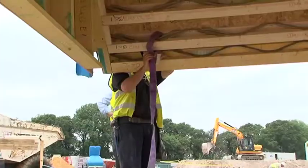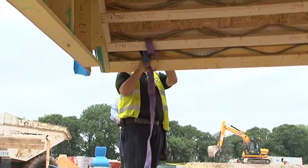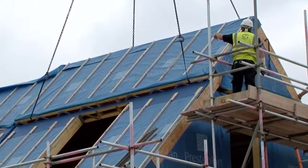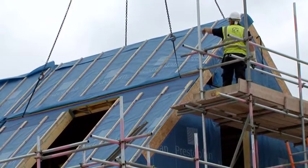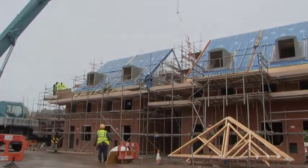After checking the section is safe for lifting, raise it to a height to attach the tagline. The ridge section can now be installed following the same procedures as the other cassettes. After all the panels have been timber locked into place, do a final check to ensure that the gable panels are in line and level, and remove any bracing that has been used. And quite simply, that's a press roof complete.